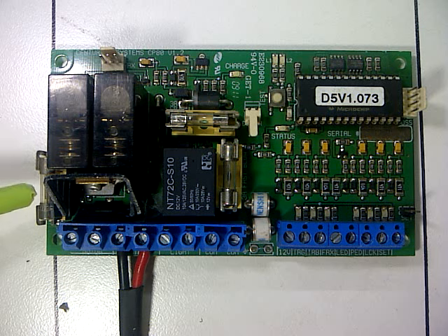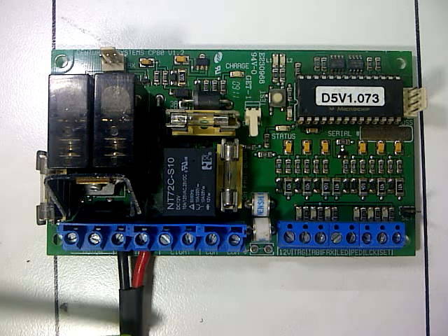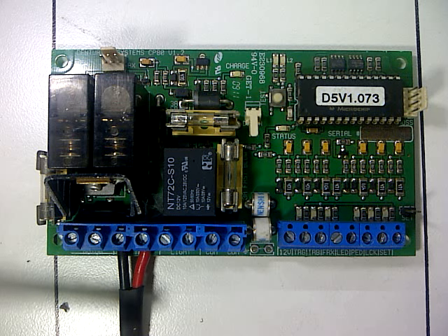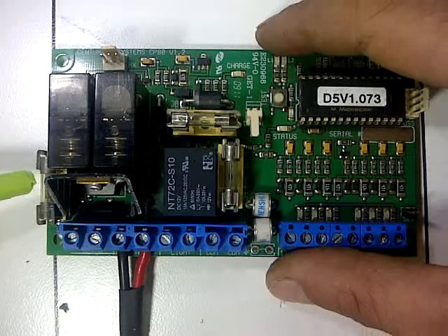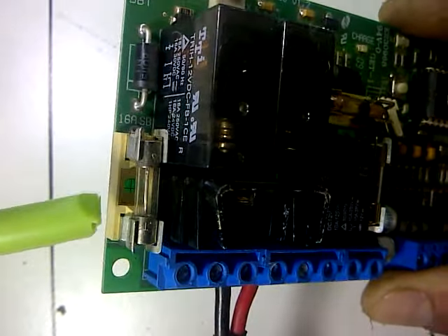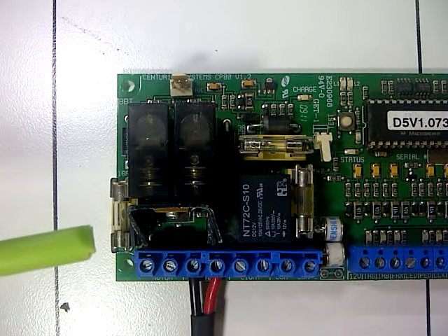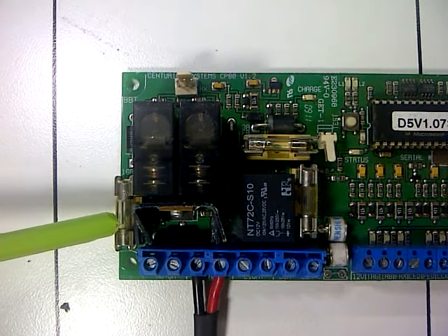This is your motor fuse. The most obvious reason for your motor not working is either your battery is getting low, exhausted, or depleted — your battery is out of the range of the average life span — or your motor fuse is blown. You can see that is your hybrid fuse that powers your relays. So if you open your gate motor and you hear your motor go click click click click, you know that that fuse is blown 90% of the time.